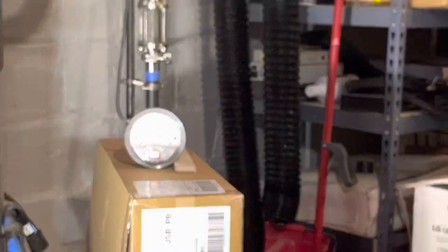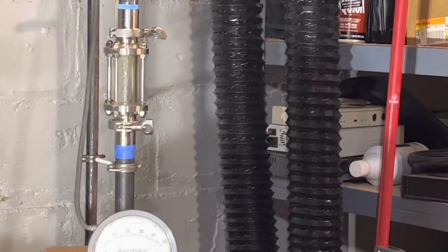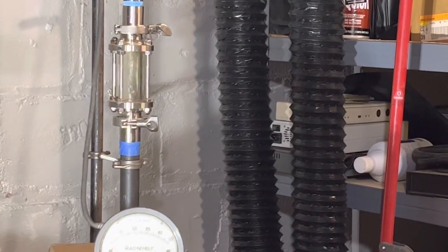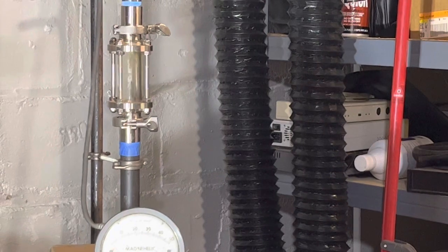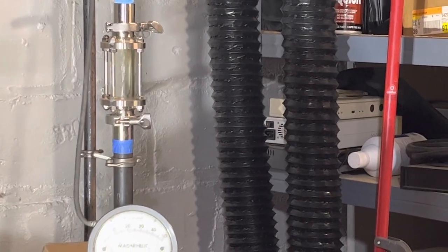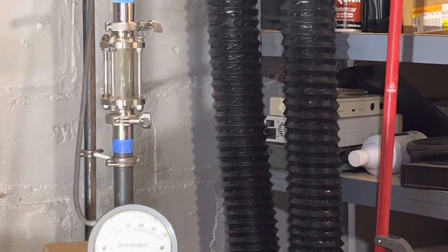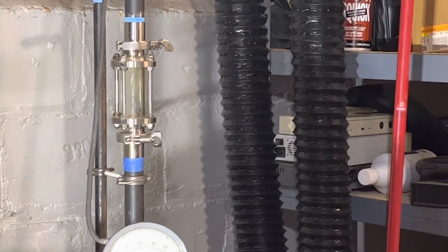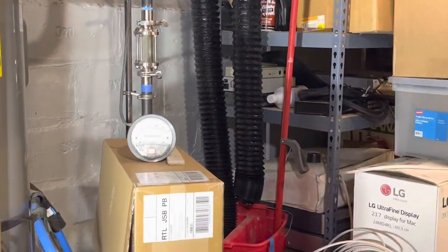So this is sort of an event. We've got condensation coming all the way around the main now. So this is the condensation from the main heating up that we're looking at here. And basically all the steam that's getting produced right now is going into heating the main up, and there's the water from it. So reset us back here.